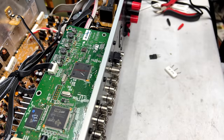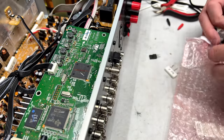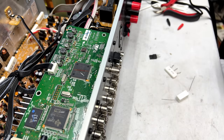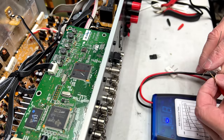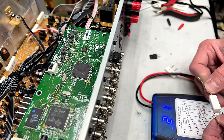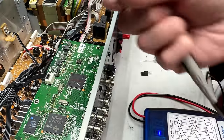Let's see if the emitter resistors are good — I'm betting they're not. Using the ESR meter, which is the most accurate for this kind of thing: 0.21 ohms and 0.21 ohms. That might actually be in spec — we might be able to reuse this. Just for giggles, let me pull out some of the 0.22-ohm replacements I bought. The five-watt parts I intended to replace these with — it's just the other channels don't need this done. Also, I'm finding a staggering amount of bad solder joints on the board underneath this thing. Reading again: 0.21 ohms — same deal. So I'm going to gamble: this emitter resistor is good and I'm going to throw it back in — no need to replace these today.